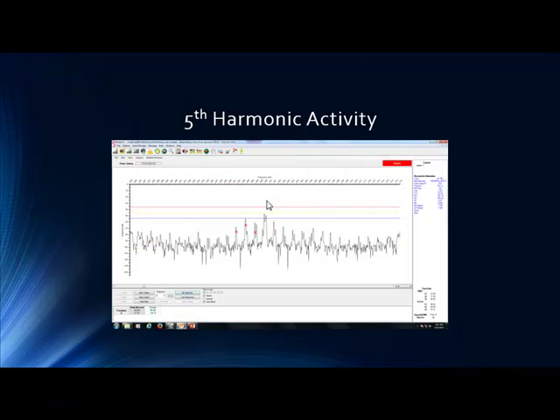We also looked at the fifth harmonic, and this correlates quite well with the pole-pass frequency. For a four-pole or higher motor, the swirl effect is a great additional tool to confirm rotor bars. There are loads that can create pole-pass, but the swirl effect is not one — so this can confirm a magnetic rotor-related anomaly versus just a load-related one.